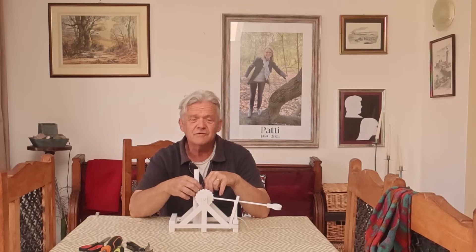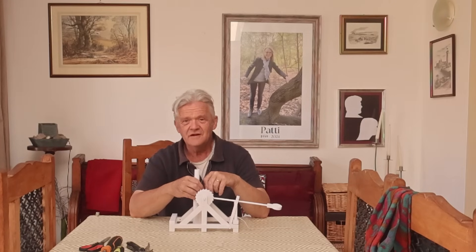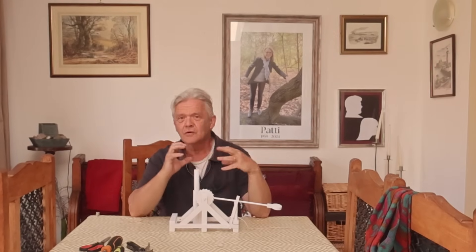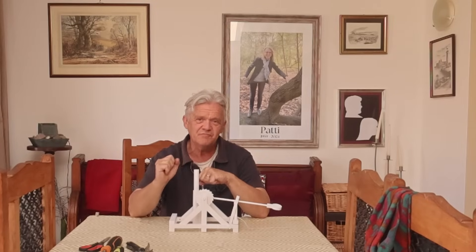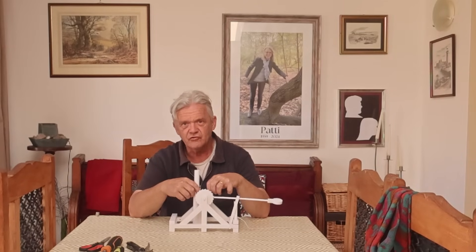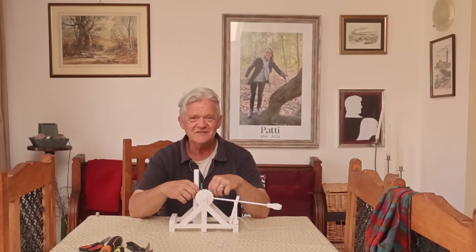In 1405, fusees were seen in loading crossbows. They're generally thought to have appeared in clocks around the end of the 15th century. What we're going to do is create a fusee so we can use our magnetic spring more evenly, rather than having it give that massive push — just like in a clock spring. To do that we're going to turn to FreeCAD, because Tinkercad isn't very good at drawing spirals and we want a conical spiral. FreeCAD however is absolutely brilliant at it.